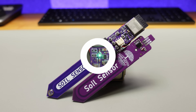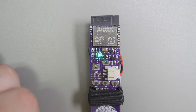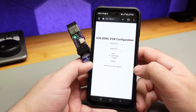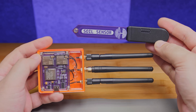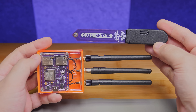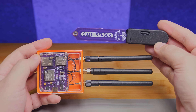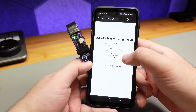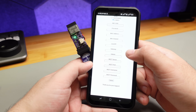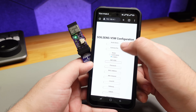I'll be selling a couple dozen of these kits in my shop, but all the files are available for self-assembly. To configure the sensor you'll need to put it into configuration mode — detailed instructions are available on GitHub. The sensor supports two modes: ESP-NOW and WiFi. In ESP-NOW mode the sensor works with a Capi bridge (link in the description); the only required configuration is the gateway key and sensor name. The advantages of this mode are much greater range than WiFi and improved power efficiency.